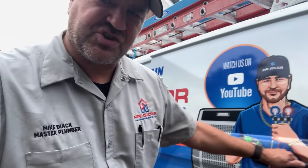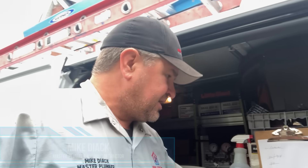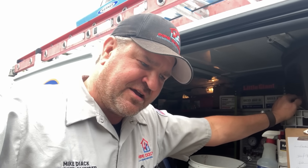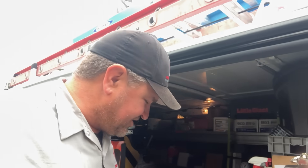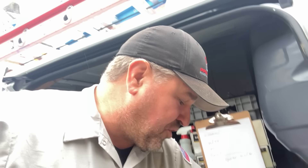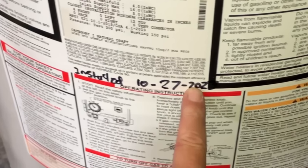What's going on, ladies and gentlemen, thank you so much for tuning in, it's me Mikey Pipes. I'm at my next service call - the customer's got a Bradford White, I think it's a 50-gallon gas-fired water heater. It's got some leakage coming from the temperature and pressure safety relief valve - that brass-looking thing on the side of the water heater that goes off at 212 degrees or 150 PSI. It's just discharging some water, and the homeowner's worried about the condition of the tank. It was only installed about two years ago, so why would the T&P valve be dripping?